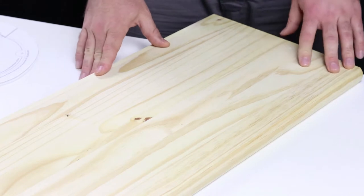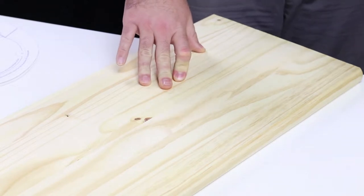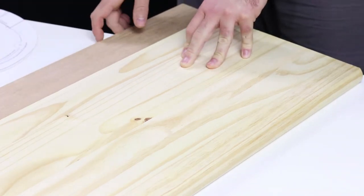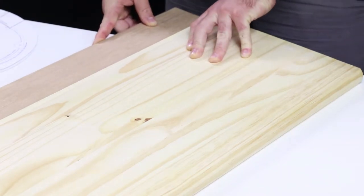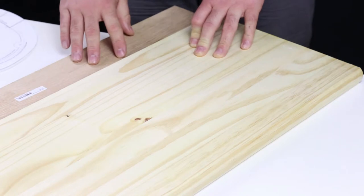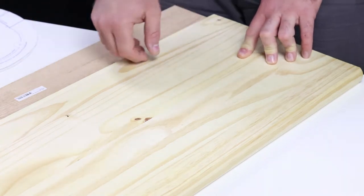And so for mating the oak wood core to the pine wings, we need perfectly straight lines. So one thing that I do as a shortcut, and to not need anything like a planer or anything crazy like that, is I just use the already factory straight lines of the side of the board.